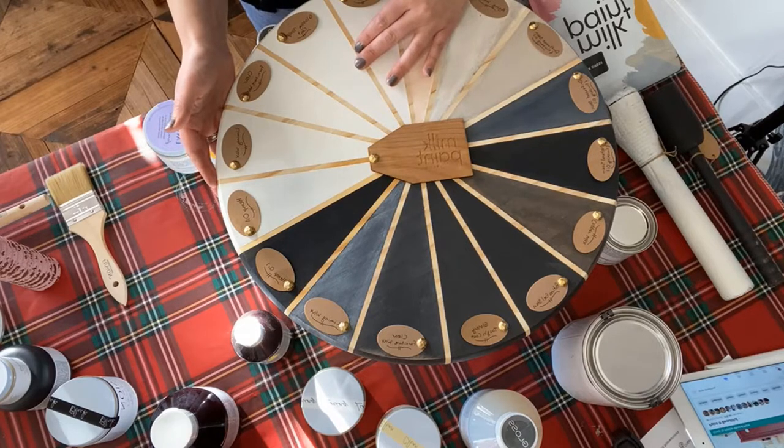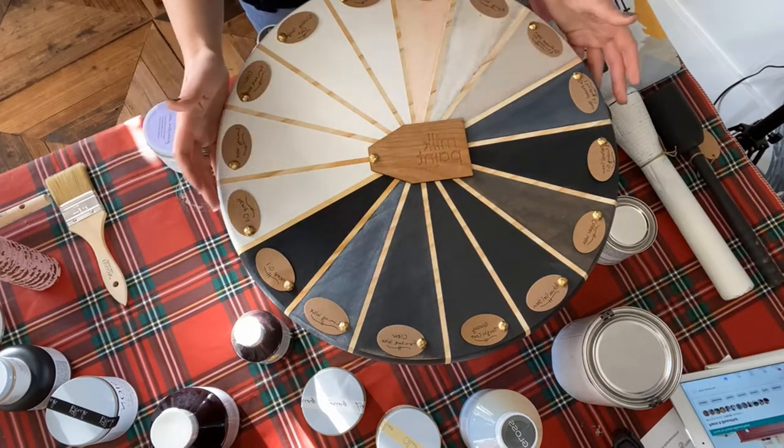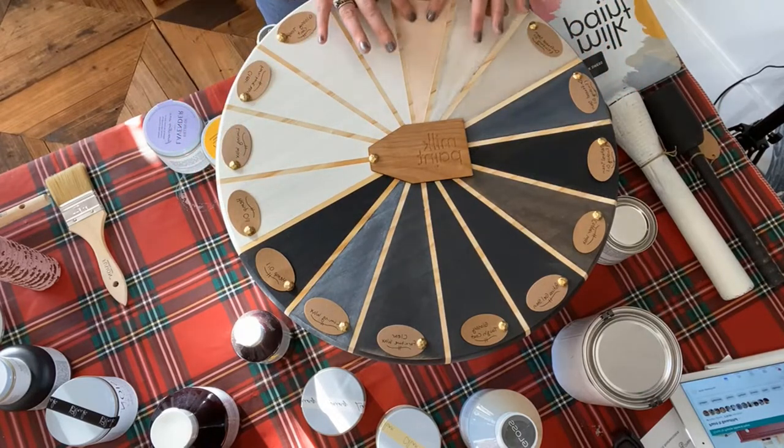In general, we love to use oil-based top coats on our dark colors because they really make the vibrancy of dark colors pop. We like to stick with water-based options for our lighter colors. You don't want to put anything oil-based over a white, because oils are going to make whites kind of yellow.